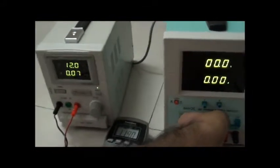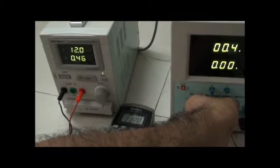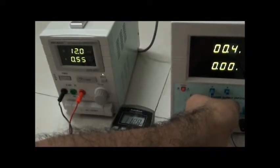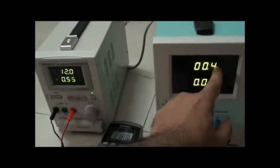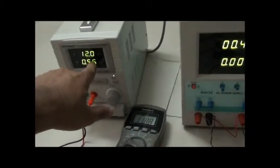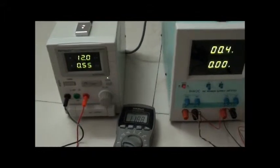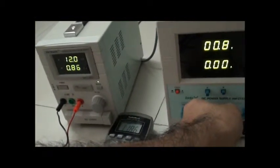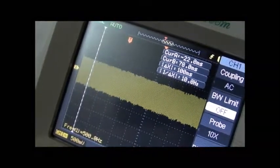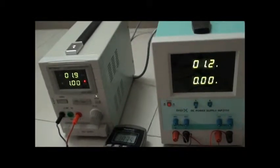Repeating the test at 12 volts. Increasing the current demand — I can see roughly the same current on both displays, with a difference of about 0.1 amps. The display only shows one decimal place, so it could read 0.4, 0.5, or 0.55. The ripple increases as the current approaches the set limit. Beyond 1 amp the output voltage falls to zero, which is better behavior than at 3.3 volts.